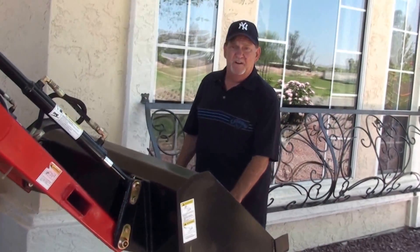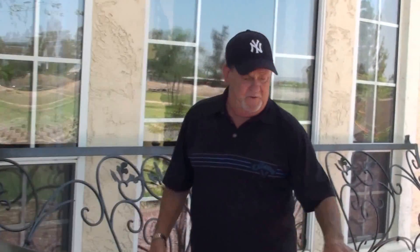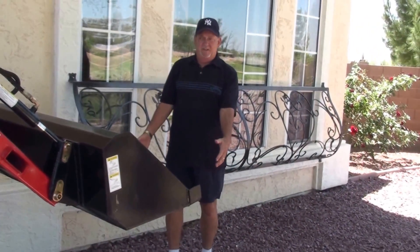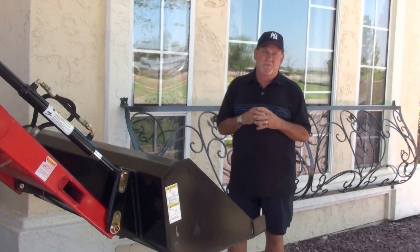This size tractor, being 27-horse, typically comes with a five-foot front bucket. Why is that important? When you get into this size tractor, it pretty much commands that requirement. If this bucket were filled with gravel, such as you see over here, it has the capacity to pick up 500 pounds. But if you were to hang a chain on the lip of this bucket and try to pick up a pallet of something, this size tractor will pick up about 800 pounds. So there are two kinds of lift — most people won't tell you that. I'm trying to help customers determine what they really need and find a tractor that fits that requirement.